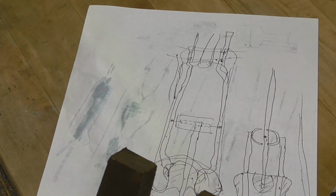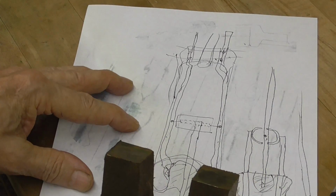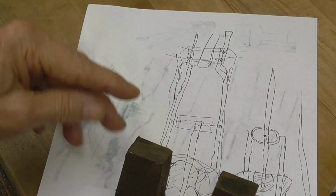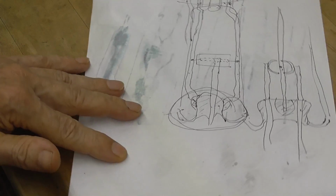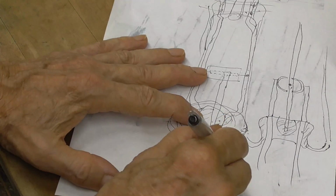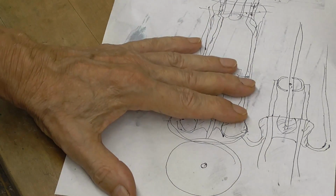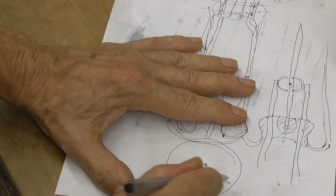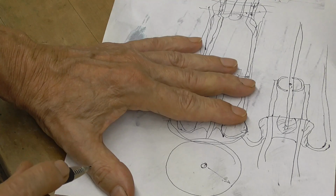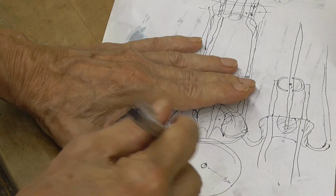Now, there are two things about the magnetron. The strength of the magnetic field determines how much voltage it takes to go ahead and reach cutoff. Okay, if we draw the magnetron, if that's the plate assembly right there, and the cathode's in the middle, we're looking straight down on it. Okay, if we have no magnetic field at all, when the cathode emits, the electrons will travel straight out to hit the plate.